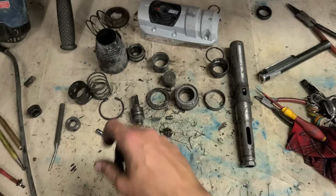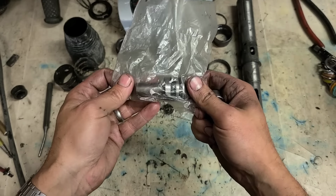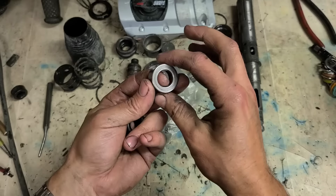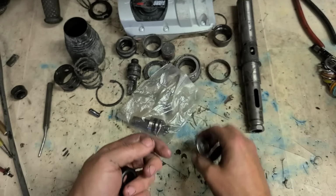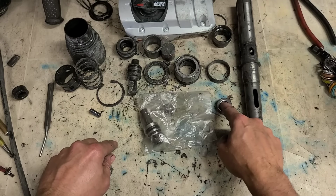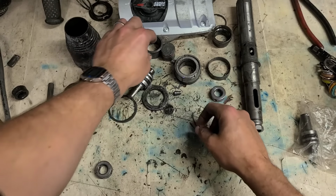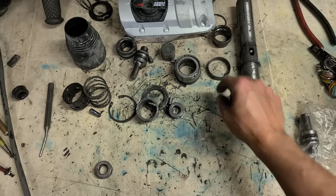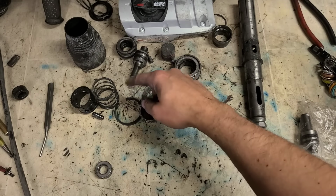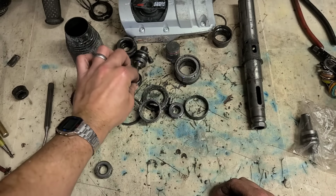See if I have one of these now. Okay, we're in luck. I have one in stock. Plus, I have the wee steel bush as well. Funnily enough, that's not sold separately from Bosch. To buy that, you actually have to buy this whole lock assembly kit. So if you want the pins or this, you actually have to buy basically all of that there together, not including the striker itself. Everything that slides on here basically without the tool holder or the striker. And it also includes the piston O-ring and the hammer, and this here hammer O-ring as well, plus the little rubber bump.